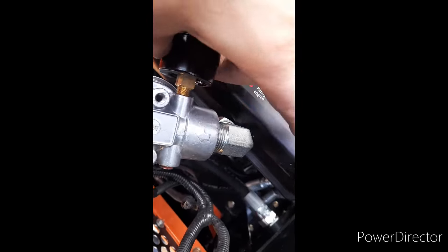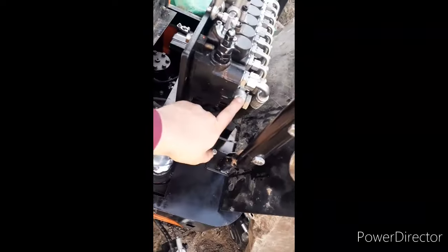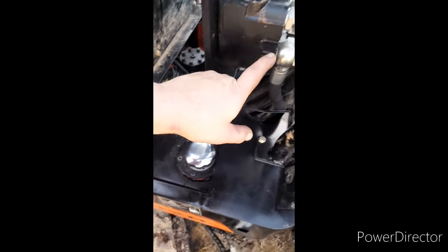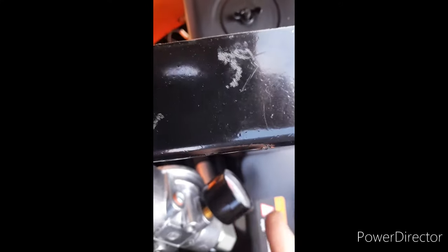After making sure that the hydraulic hoses are all nice and tight all the way around, and making sure that the inlet and the outlet are in the proper spots, I can now take that little plug out and install my little pressure gauge. In hindsight, this would go a lot easier if you made this connection down here while you have this main hose out — it is kind of a pain in the butt getting the wrenches down in there. So while you have this off, connect these two hoses together and it'll save you a lot of monkeying around.